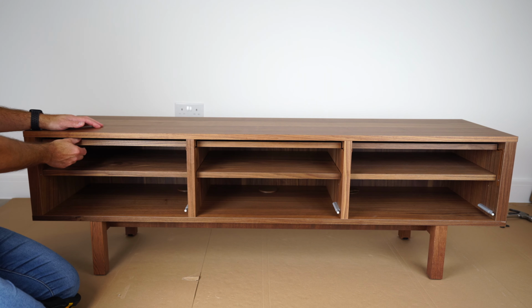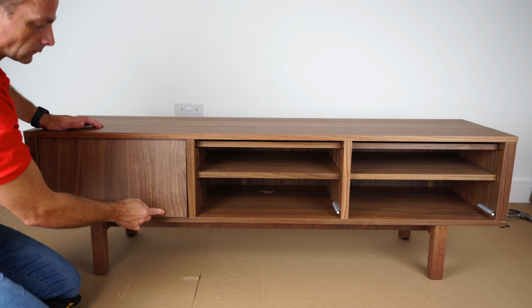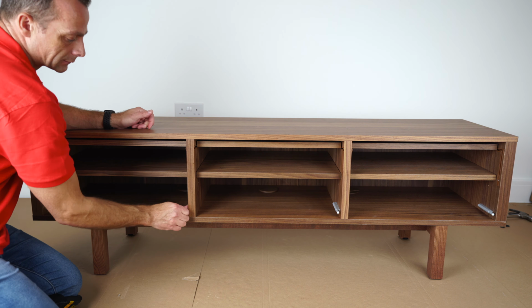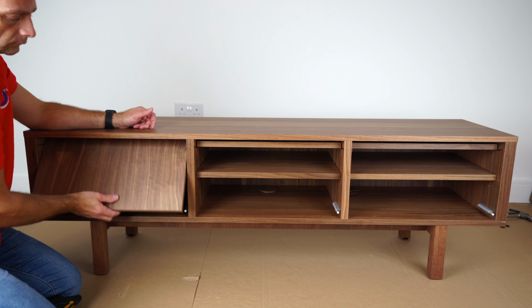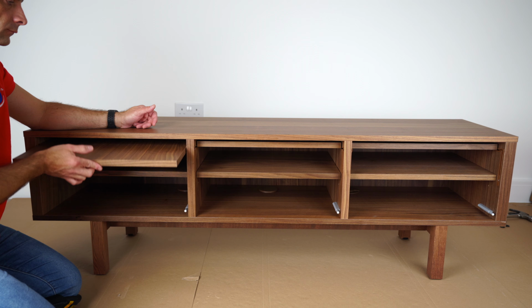Now you see I'm gonna close the door as they're supposed to be, and it should just pop out nicely. If not, you can unscrew the pop-up mechanism slightly. So just open the doors and screw it slightly till you're gonna be able to just click it and comfortably open the door. Just like that, they stay open. You click one more time and they open. Good. I'm gonna adjust the other 2 as well.